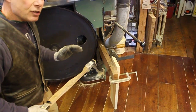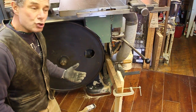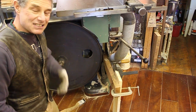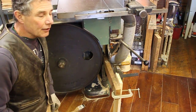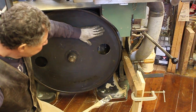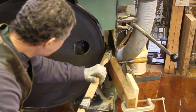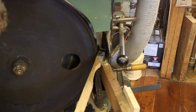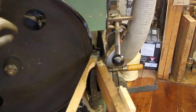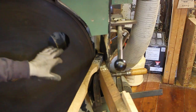The faint-hearted craftsman shouldn't try this — somebody may say that's crazy and that's not the way you should do this. But it's how we did it in the pattern shop back in the 70s. I learned from a pattern maker who was a World War II POW — a fabulous man — with this wheel actually spinning. You take your tool rest with the sandpaper and come in to the very edge of the tire so that as the bandsaw is turning, you're sanding off material off the edge of the tire.